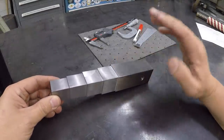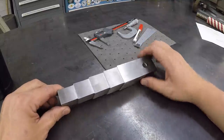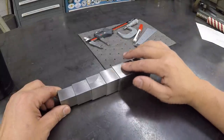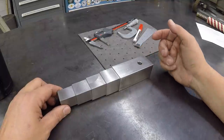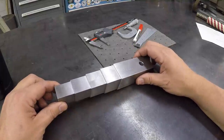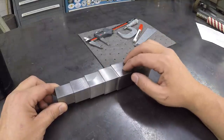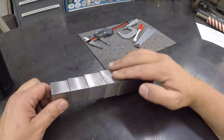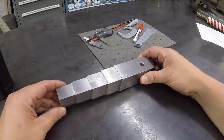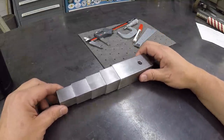One of the things is that right now I'm actually waiting on my quenching oil for the heat treating, which should be here today. But one of the things I overlooked was a common practice whenever you're heat treating carbon steel: they make this stainless foil wrap that you wrap your part in to make it airtight. That helps prevent oxidation on the surface whenever the part is going through the heat treating and starts touching the oxygen. The foil wrap helps keep the part clean. So I think I'm going to get some of that ordered today. It should be here tomorrow if I order it today.